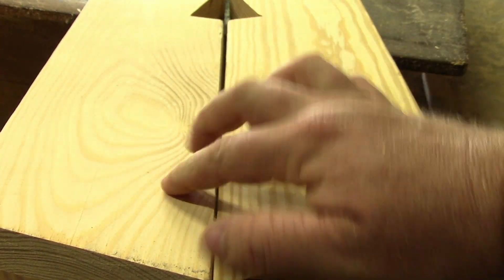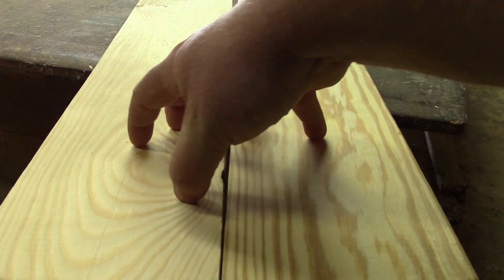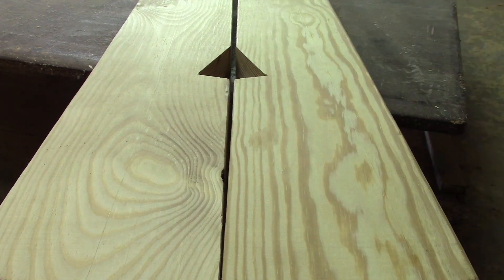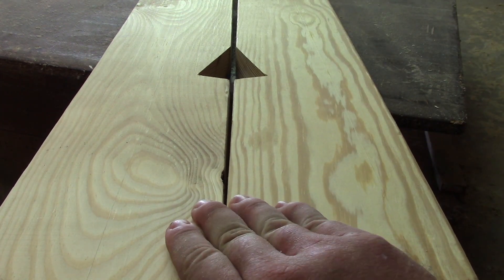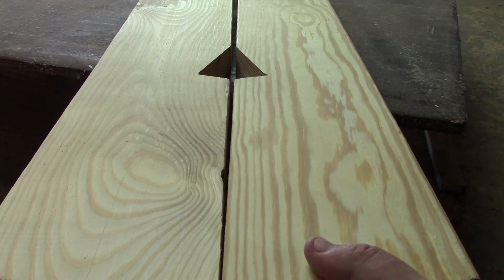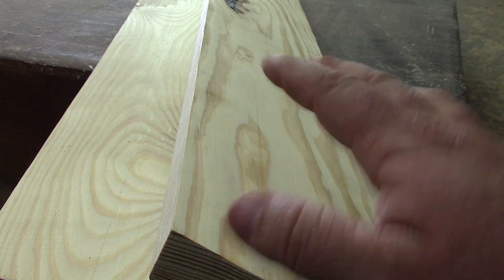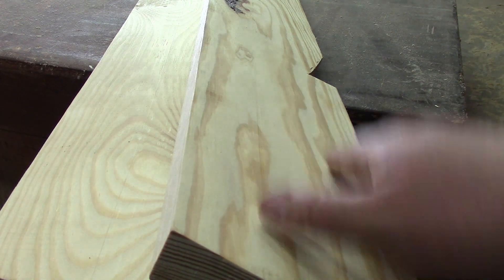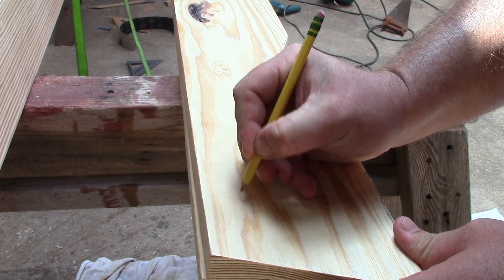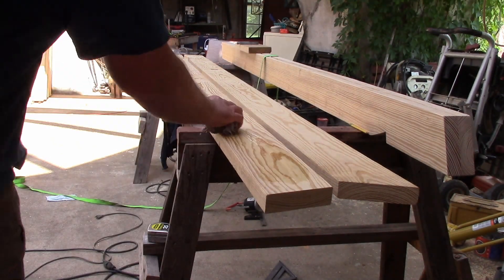It's not perfect — you can see a few little lines where I have nicks in my blades on the planer — but oh my god, it's just an amazing feeling to have a flat surface. You put a bead of glue and it just squishes out all sides. This is going to be really nice — just make one solid piece of wood out of these two rafters. I'm going to hit the outsides with 120 sandpaper on a palm sander, just because I've had a little bit of problems with putting the oil on and having the grain raise. So before I get crazy with the glue, I'm going to go ahead and mark my screw holes. Towards the ends I like to put a couple screws — we've been doing every eight inches. First step is I'm just going to wet my gluing surfaces.